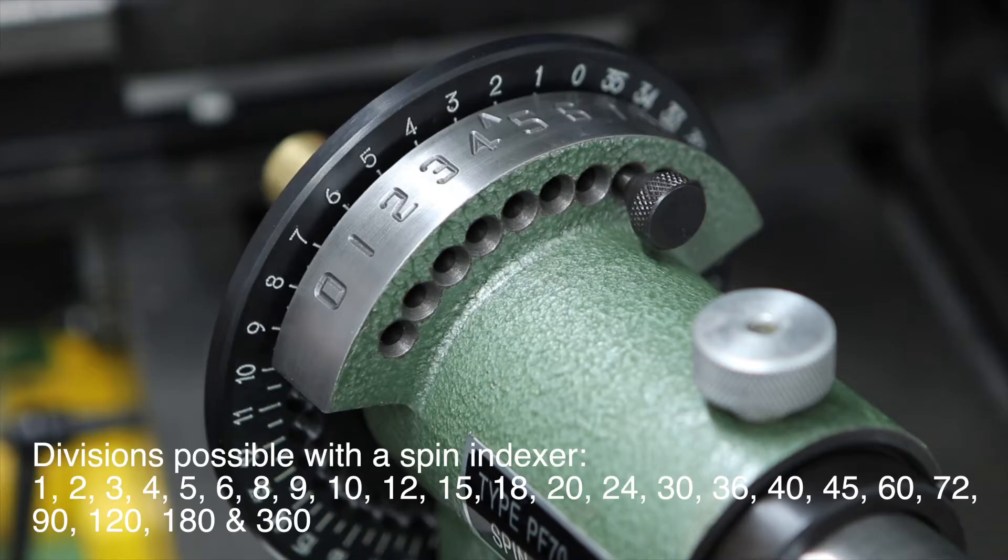That's a number divided into 360 with no remainder, so we could divide into 3, into 6, into 12, into 18, 30 and so forth, which is incredibly useful. But it also limits us - if you wanted to cut a 62 tooth gear wheel, you couldn't do that with this indexing head as it currently stands. To do that you'd need to use a more complex dividing head, or modify this with a dividing plate with a different number of holes in it. Tom Lipton has actually done this on his channel Ox Tools - I'll leave a link in the description to his video so you can check that out if you're interested.